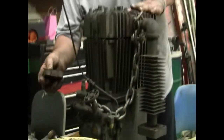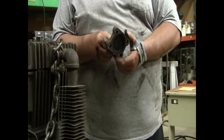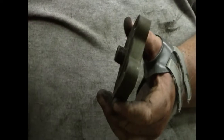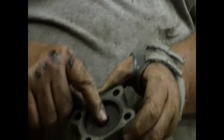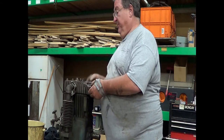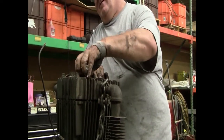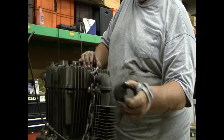Let's get a close-up of one of these valve plates. This screw right here — when you put this together, you need to have it quite a ways out, at least past the flush point on the bottom. That way when you go back together, you torque your bolts down and then screw the screw down and your valve is tight. That spacer is what the screw hits to hold the valve down.